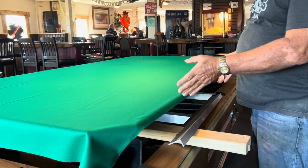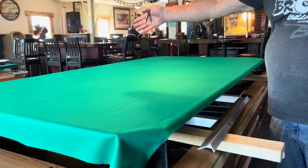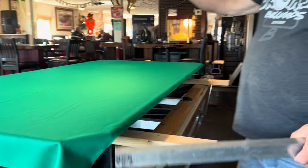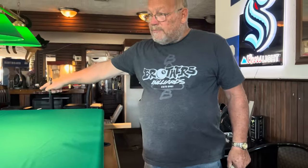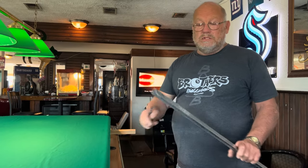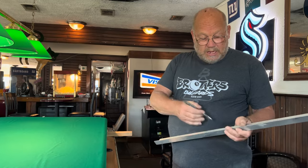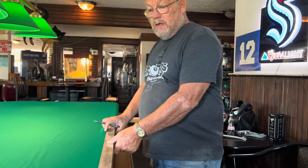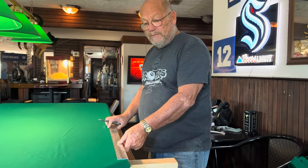And once you've got that done, this is the anchor side, and that becomes the stretch two side. So, as JR took his stretch index test, we clamped one side of the slate, he came over here, he stretched it, and he was able to stretch it to 2 1/4 inches. So with it stretched to 2 1/4, when you back off 3/4 inch for your working stretch, that gives you 1.5 inches of stretch. So this, a piece of aluminum, the inside of it represents 1.5 inches width. So when you put this on here, this becomes your 1.5 inches.